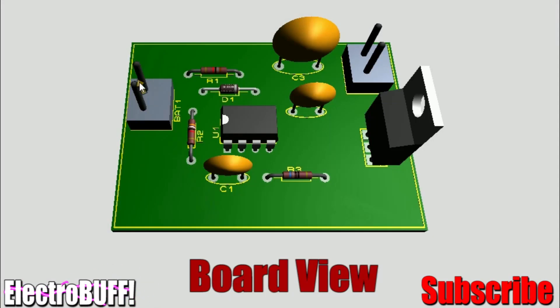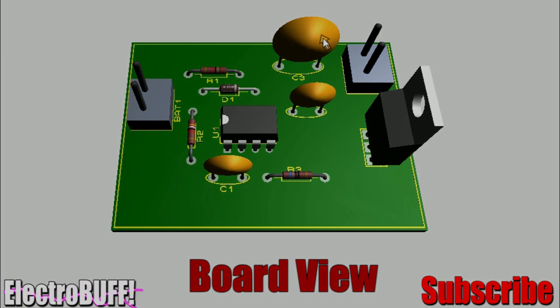The final board is as shown, with the input going here and this is the connection to the transformer. The resonance capacitor should be an unpolarized one — you can salvage them from old switch-mode power supplies where they are used as input filters.